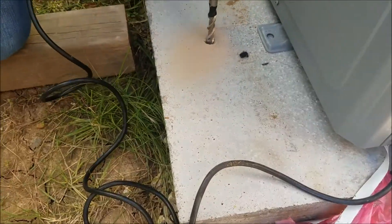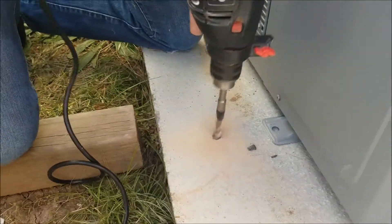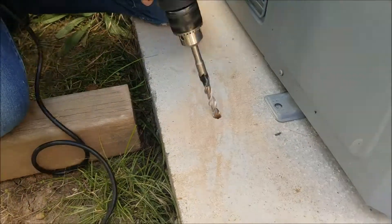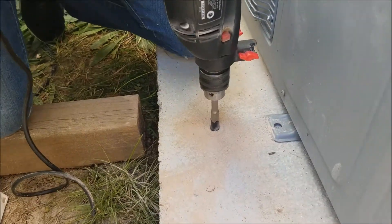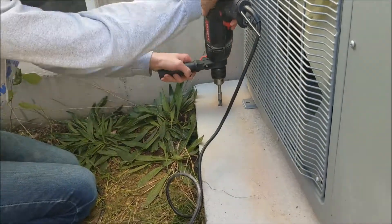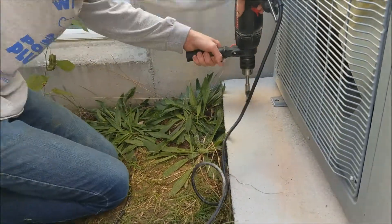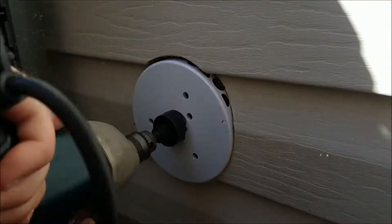When mounting your concrete anchors, put the outdoor unit on the concrete pad, mark it off with a magic marker, then do a little pre-drilling before using the drill bit. Otherwise the bit will walk away on the concrete. I wasn't paying attention and my helper let the bit walk, so I had to re-drill one hole — not a big deal, just a word to the wise. Also, measure how long the anchor needs to go in and put tape on the bit to mark the exact depth needed.